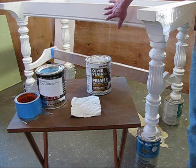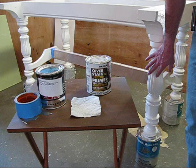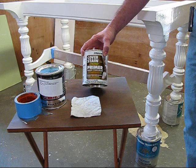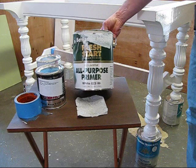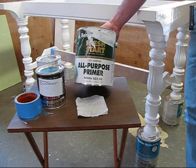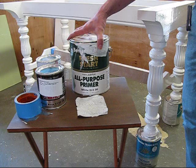Now the table base has been finished — the final coat is on. Let me tell you the order of paint I used. The legs had paint on them, most likely oil-based, so I used an oil-based primer: Cover Stain by Zinsser. Once I did the legs with the Zinsser, I let it dry, lightly sanded the legs, and then painted the entire base including the legs with acrylic primer Fresh Start by Benjamin Moore. I put three coats of Fresh Start on because I want to build up a high volume of paint on the base — I want it to look as if it has decades and decades of paint on it.